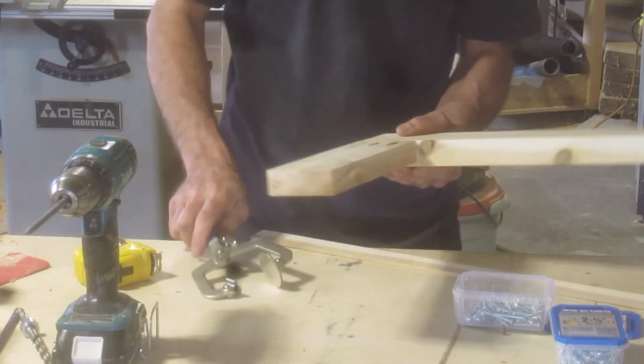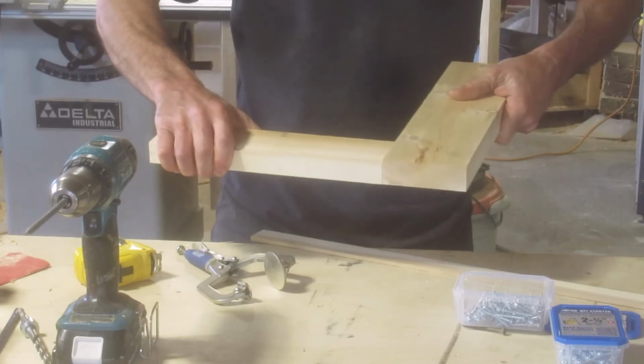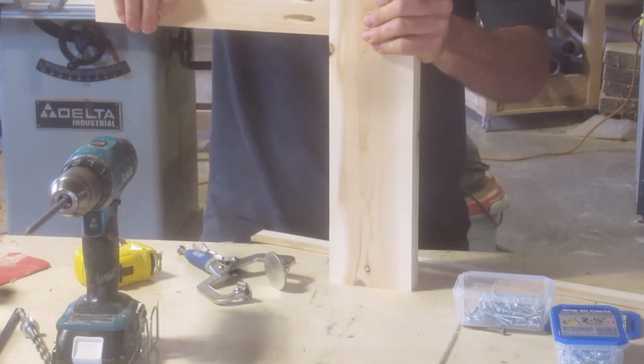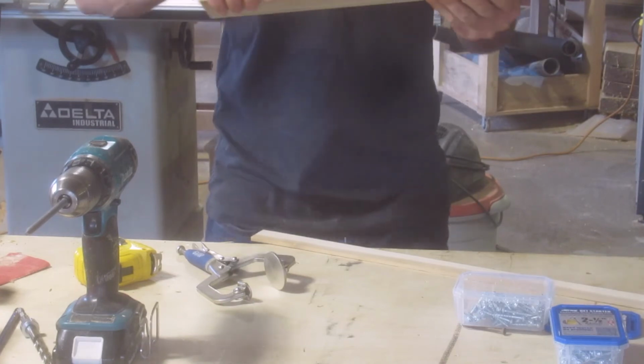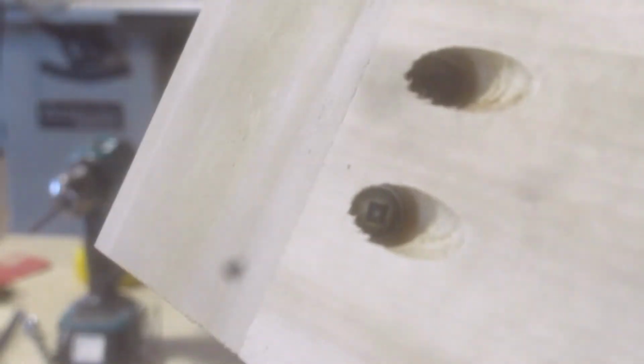This is cedar, the material, the intended material. Show you, since this is where I had the shim. Where's my finger? This is where I had the shim, right? And these are where I poked the holes, jig pocket holes. Those are both the screws. The bottom one is the silvery one, which is the indoor type. And that's a deck screw. Okay, it's not popping out on the other side.